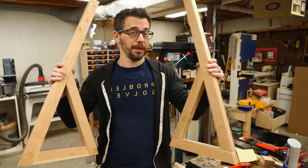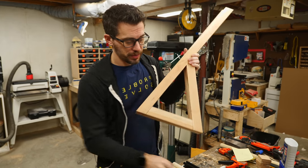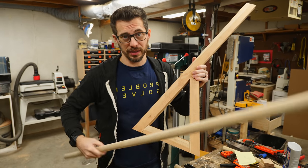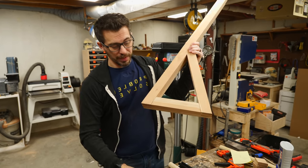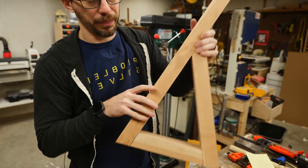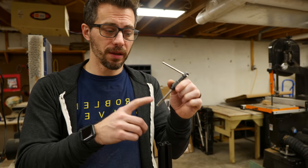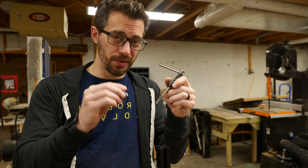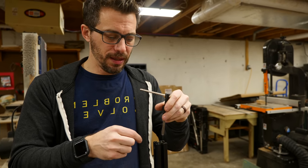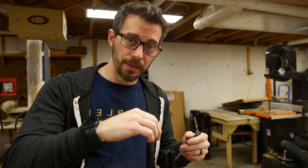The glue on these is dry and we're ready to move on. The next step is to attach these together, and to do that I'm going to use some big pieces of poplar dowel — these are one and an eighth inch thick and they shouldn't flex over the distance I'm going to use. We'll drill some holes through both pieces and drive those dowels in on the front and back on the bottom, but at the top we're actually going to connect them with aluminum extrusion. Unfortunately the largest tap I have is too small for this opening, so instead I'm going to use a steel screw and turn that into the aluminum to create the threads, using the tap just to get it started so there's something to bite into.